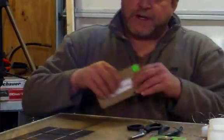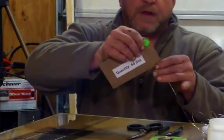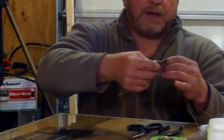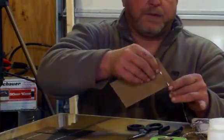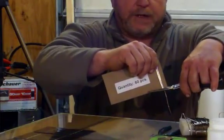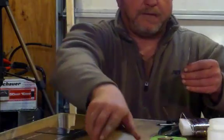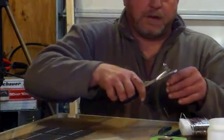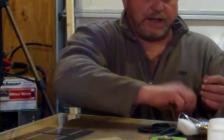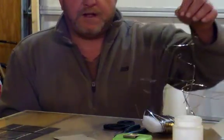What I found — the trick — is that a lot of times your cells come in a box and you've got a little piece of packing material. If you take the packing material, which is the same size, or cut a piece of cardboard the same size as your panel, and you start with your tabbing wire and just gently wrap it in a very smooth fashion around the cardboard. Instead of wrapping the whole wire individually, when I come down here I cut it off, come over here, slide all my tabbing wire off, and cut one end. You therefore have the actual correct length of tabbing wire. I'll cut and wrap pretty much a whole spool this way — most of your tabbing wire ends up the right length just like this.